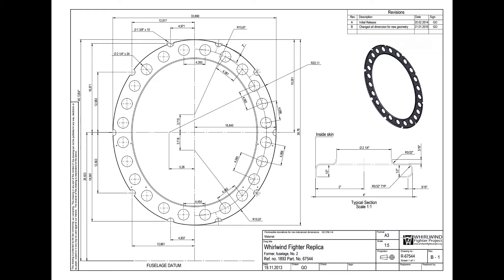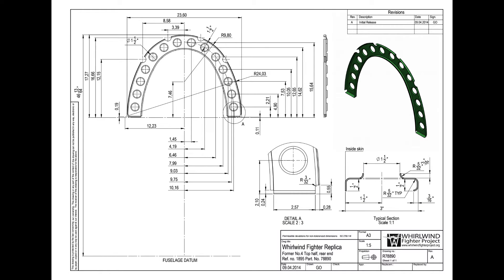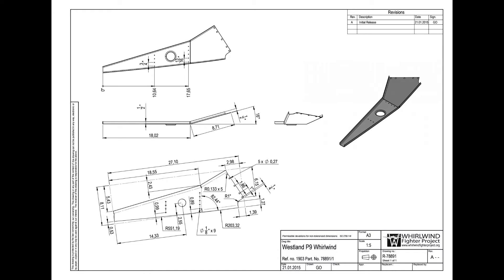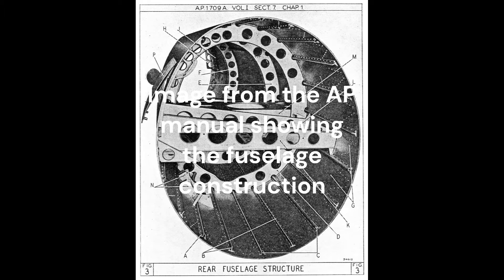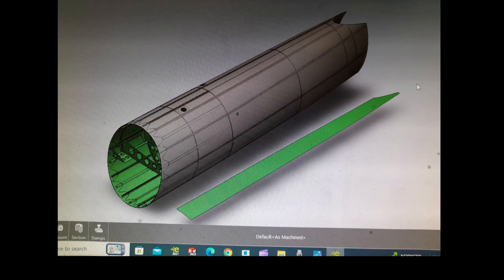A single half-hoop frame and two quarter frames, connected to a port and starboard gusset plate, provide the foundation structure for the retractable tailwheel lock plate on the vertical fin spar, when the undercarriage is in the down position. To provide the strength to resist the vertical and horizontal bending moments exerted on the fuselage, and resist the torsional forces exerted by the tailplane and rudder in flight,